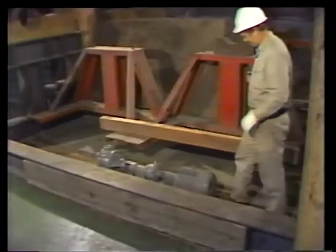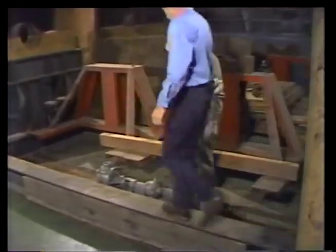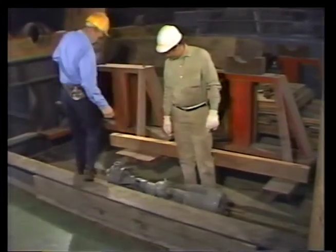You'll remember that the 4 basic steps in planning any rigging job are finding the weight, checking the balance of the load, making sure you've got room to move the load, and selecting the equipment. Let's go through these steps one at a time. Norris is responsible for getting this unit moved to the floor below for installation.